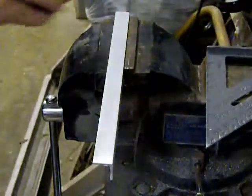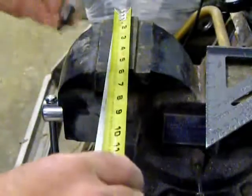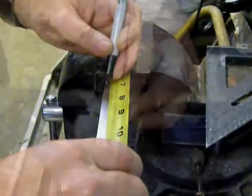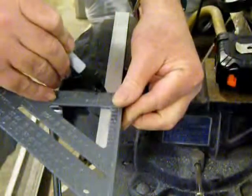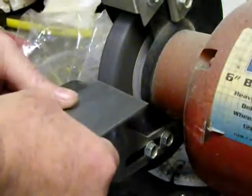Now I need to cut the angle brace. It's 7 1/4 inches long. There's only one and it gets cut the same way. Now I'm going to deburr and wire brush all the ends so that they are smooth and free from sharp edges.